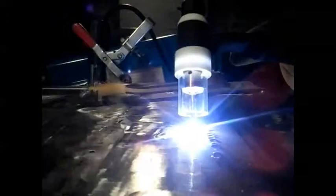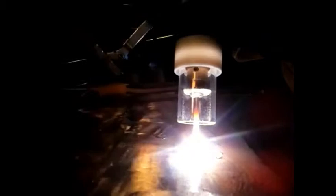With the flow turned up, let's zero out. There's our arc. Oh, that's much nicer. I don't think it's much of a gas saver at 15 CFH, but wow — that certainly makes a difference in the puddle. Look how shiny that is.